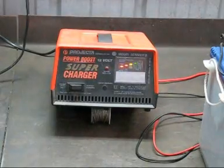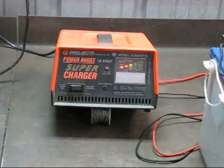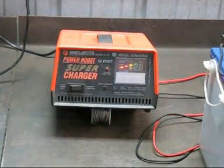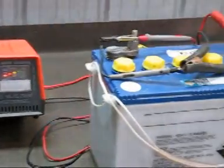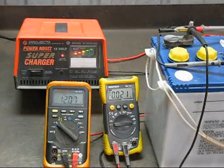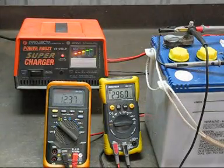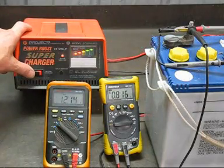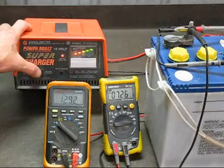I've got a battery charger claimed to be 4.75A continuous charging. I'll put an amp meter onto it and see exactly what it does do. Switching on mains power — we've got 2.9A. Now switch on the booster: 7.3A.